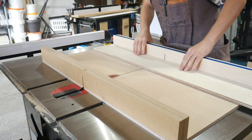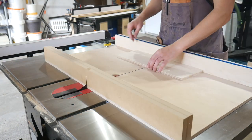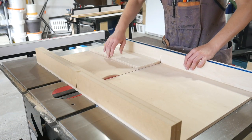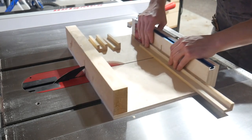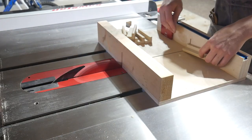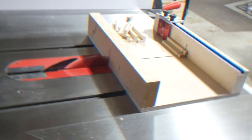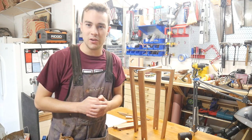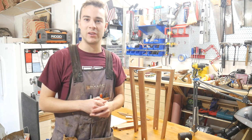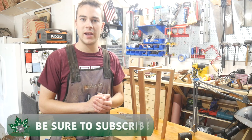With that, you've got your table saw crosscut sled complete. It's really simple, but you do have to pay attention to both dialing the fence and getting the miter bar fitted perfectly. Once you do, you're going to have an extremely accurate crosscut sled that's more accurate than any miter gauge or store-bought sled — perfectly fitted to your table saw. I really love the smaller one for small cuts, and using a stop block with it allows you to quickly make repeated cuts to the exact same length. Hopefully you enjoyed this video — leave a like, leave a comment, subscribe to the channel, and we'll see you on the next one.